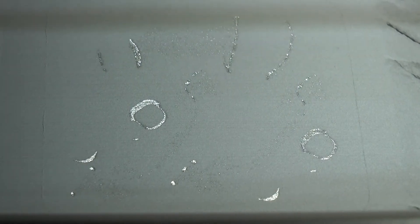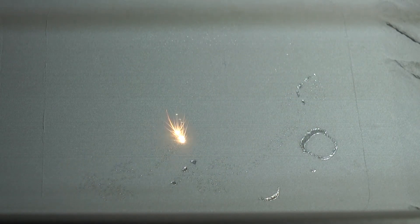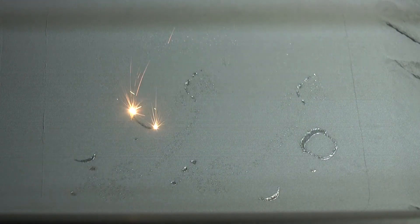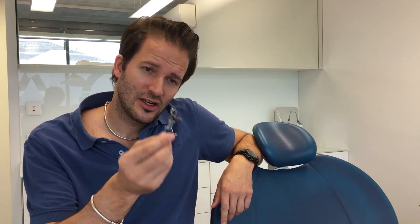This is what you see in the video right now. The grey surface is the metal alloy powder laid down in a thin layer. Locally, the laser is melting the metal powder, generating the desired structure. Then a new powder layer is added and the process goes on.